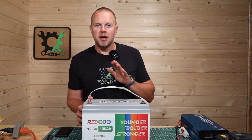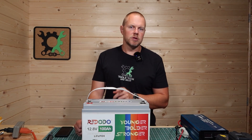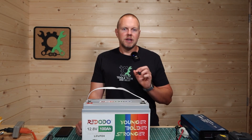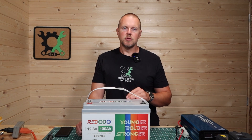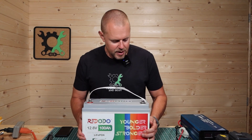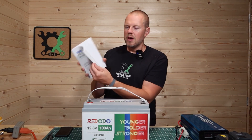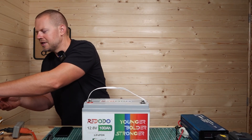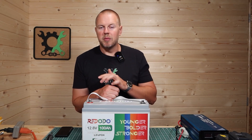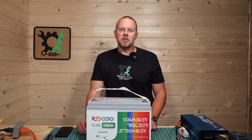I had actually performed this same test on my Landahouse YouTube channel, but the charge controller was set to 14.4 instead of 14.6 and it didn't get a full charge. So this is my redo — that extra 0.2 volts on the charge controller seems to have brought it up to its advertised value, which is good to know. As far as construction goes, it seems like a nice build, and the instruction booklet is one of the better ones I've seen. Definitely check out the links below for more information. This was given to me for a free review on my other channel. I'm Seth with Tools, Tech, and Gear — see you in the next one.